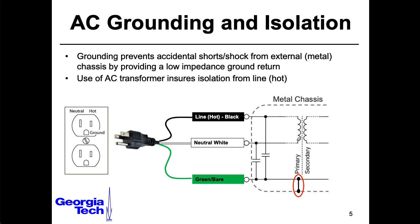Usually your device will have a transformer whose job it is to take the voltage out of the wall and step it down for most modern electronics, or step it up in the case of a tube amplifier, to create the actual voltages that you need. This is usually then passed through some sort of rectifier and voltage regulator, et cetera. The capacitors shown here are for filtering. The ones here, if you have them at all, are for filtering radio frequency interference and other electromagnetic interference, and these are very problematic — I'll come back to these capacitors a little bit later.